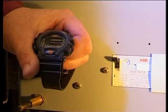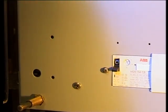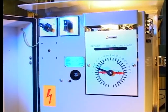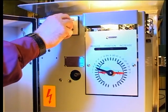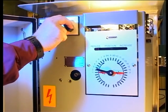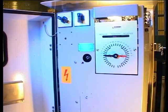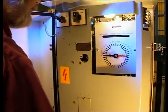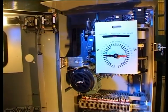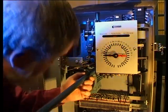The motor protection should trip within 60 seconds. If there is a time relay, disconnect it. Check the rating plate of the motor — this shows the value to which the motor protection must be set. Set the motor drive mechanism to the lowest position, one. If there is a time relay, disconnect it. Block the drive mechanically with a bar about one meter long.